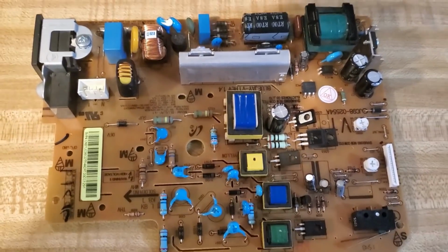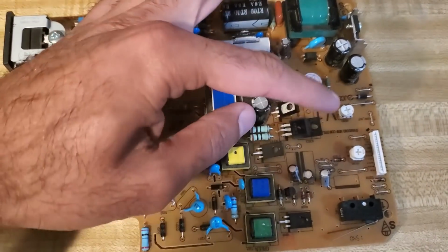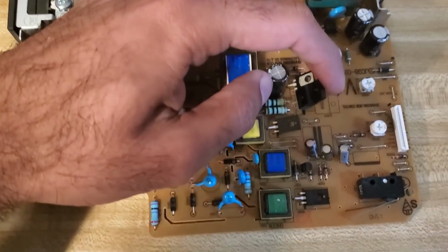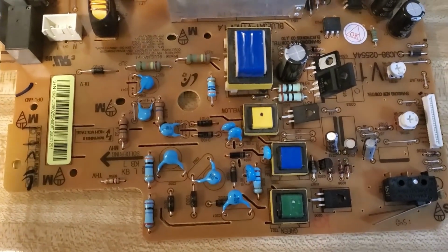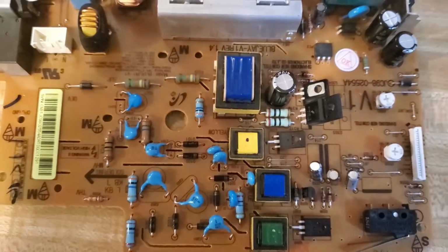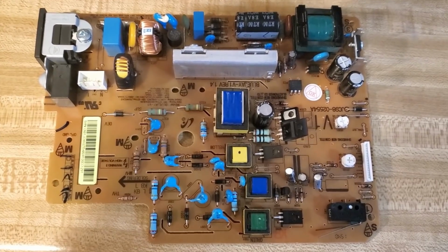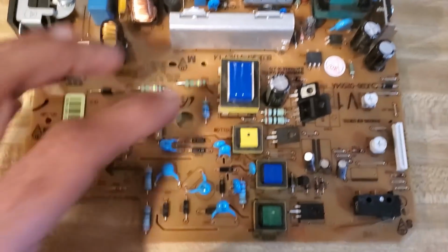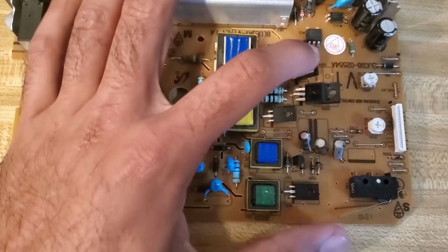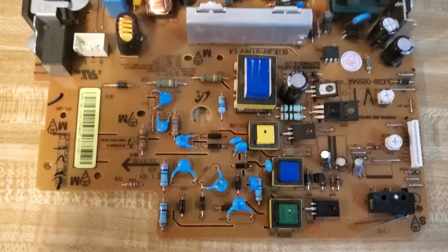Just a quick side note, a lot of these components can be found in old PCBs. I took this transistor out of a control board of an old printer. I often desolder components, look up their data sheets, and keep them on hand for projects like this. This serves as a good way to figure out how components work and also gives you free parts.